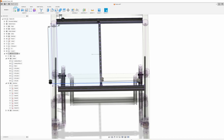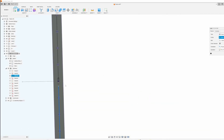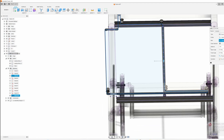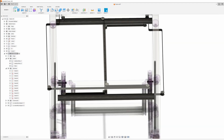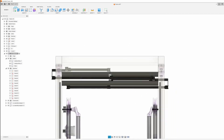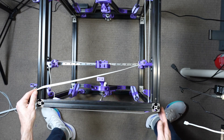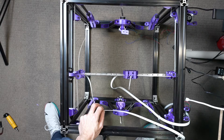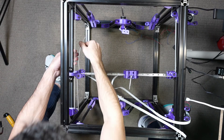Another thing to note is the layout for X and Y, known as Core XY. I devised my own implementation of it in Fusion 360 to rotate the gantry 90 degrees, creating mirrored sides and offsetting them vertically, simplifying the design. The problem was that I didn't know if it was going to work until I tried X and Y movements through the electronics, which I now did, and it seems to be working just as expected.